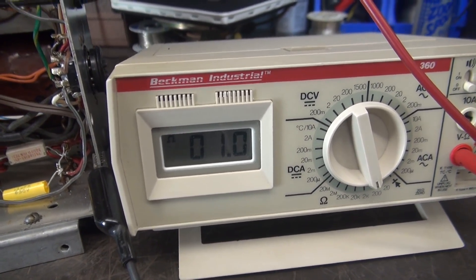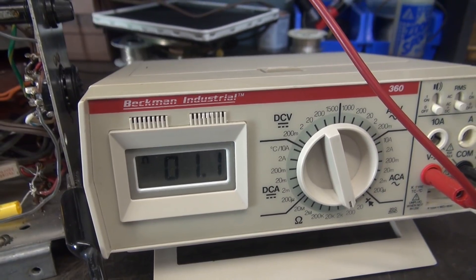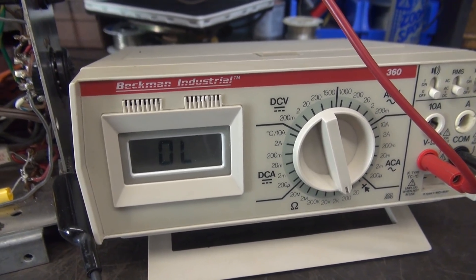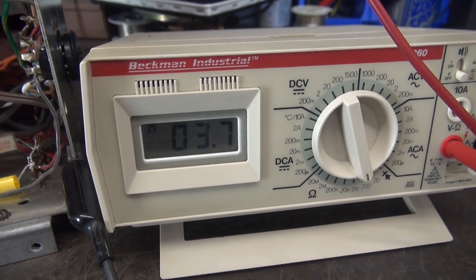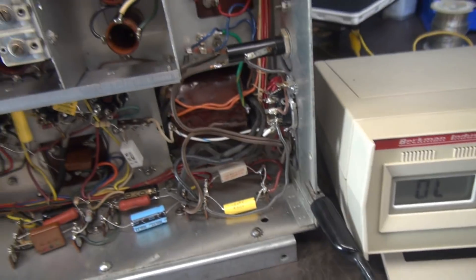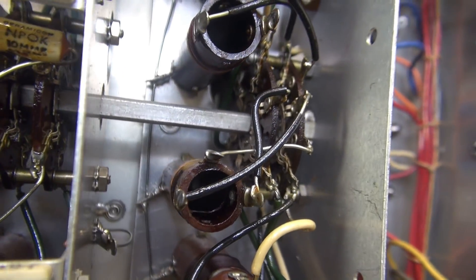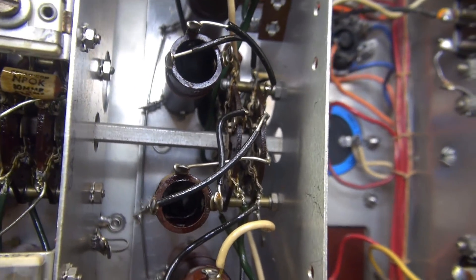If I move this selector switch slowly, you'll see the resistance change. There's band B — A and B still have about an ohm. Here's band C. Uh-oh — she's open. Here's D and E. Back to C — open. Not good. We've got an open coil. You can actually see your band select switch and the wiper in there, and trace it right to the coil you suspect.